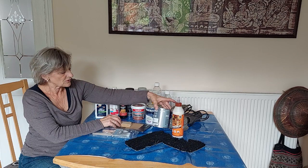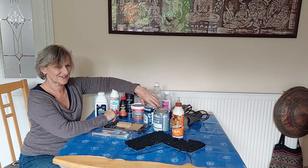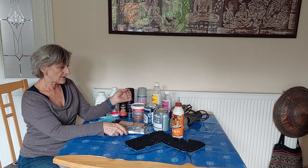We then get on to painting it. This is outdoor paint — an outdoor primer. I'll give it one coat of that and two coats of top coat which is a satin, and it says on the tin that it lasts six years. I'm using just plain paint brushes — furniture fine bristle paint brushes.